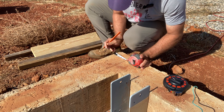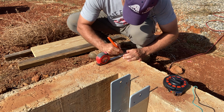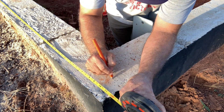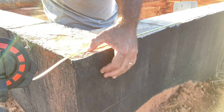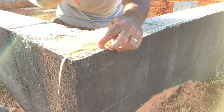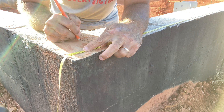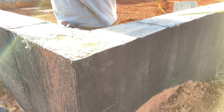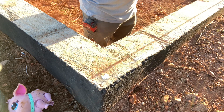This will give us a starting point of where we need to be. We measured 55 feet 10 inches on the nose. The other measurement is 55 feet 10 and one-eighth inches, so we're an eighth of an inch difference. It's probably going to be out of square a little bit, but we'll adjust and make it right.